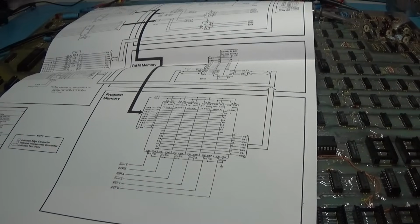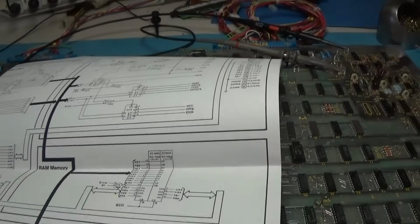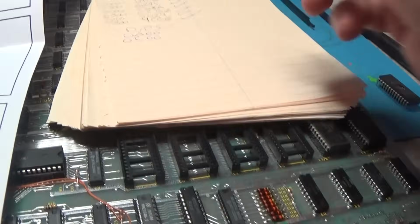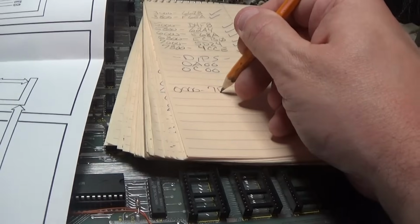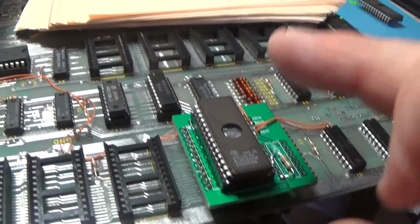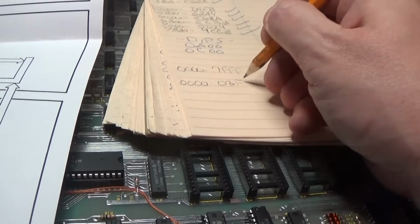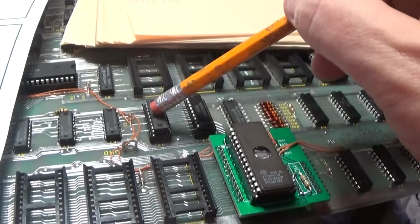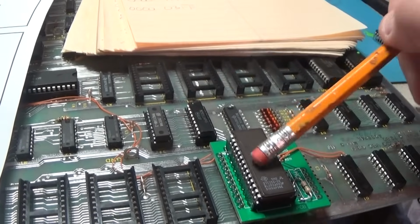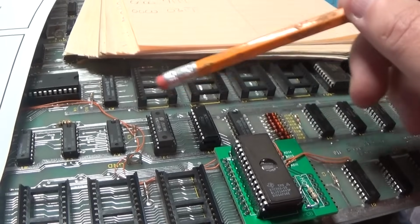Okay, unfortunately, I do believe I know what's happening. And if I grab the notepad, I'll go through what I believe is happening here. Okay, my guy here is enabled from the addresses 0000 through 7FFF because it's always enabled, okay? What we have here is this range is 0 to 3FF. That's this range. So what is going on is when this is trying to read from these, it's expecting these ranges from 0 to 3FF on this to be tri-stated and not influencing the RAM.